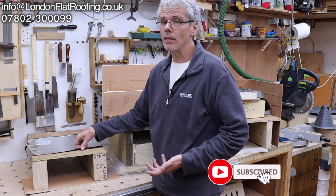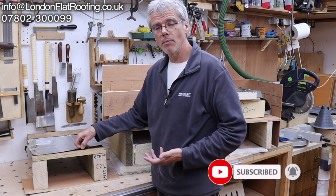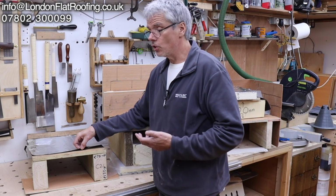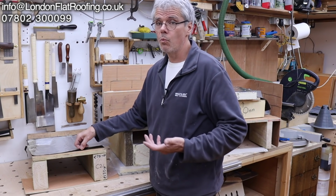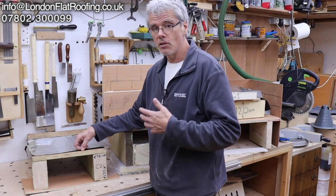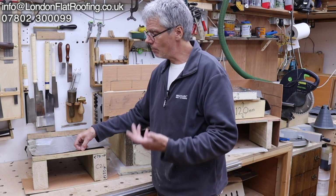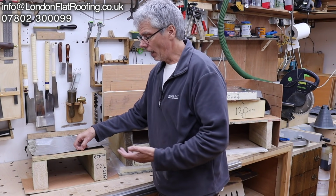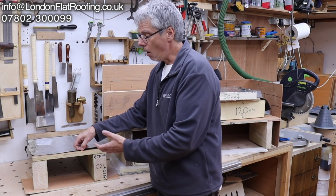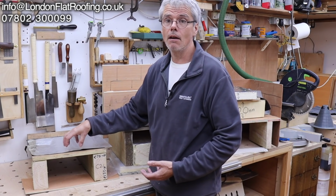Now you take a building today which is 100 or 200 years old, and the way we've changed them inside, by putting paints on the walls which don't breathe. Vinyl wallpaper was something back in the 40s or 50s or 60s, and it stopped everything from breathing. More moisture builds up, and the moisture has to get out. With double glazing, the moisture can't get out, so it's all getting forced up into the ceiling area to get out, higher moisture going in there. Now we see that this kind of thing can fail.